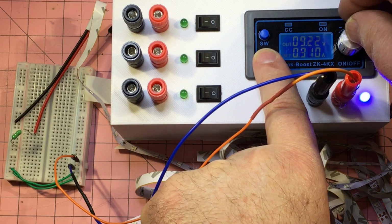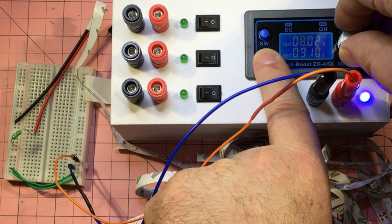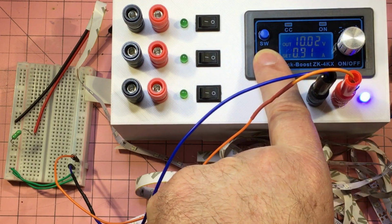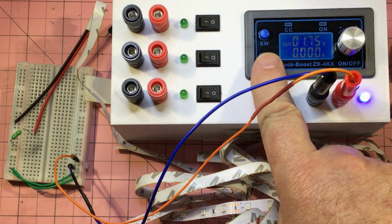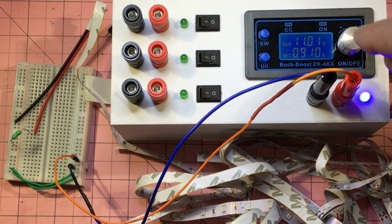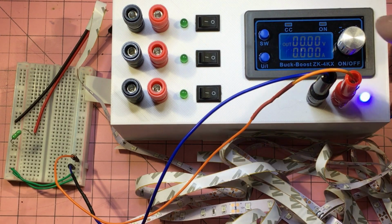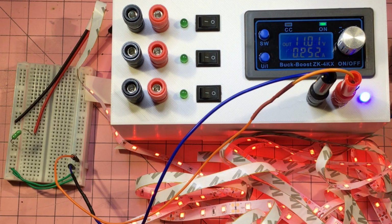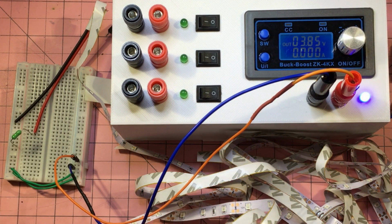Let's go to 10 volts. We'll keep the 310 milliamp. This should just blow straight away. 250. Can't say that that's a really fast blowing fuse. All right, let's go to 11. And I'm also going to change this current limit here. So firstly to 11 volts, and secondly, let's go to 500. 510. Nice. All right, should blow straight away, having said that. So around about the 250 mark. Nothing. Wow. Okay. Let's keep going then.